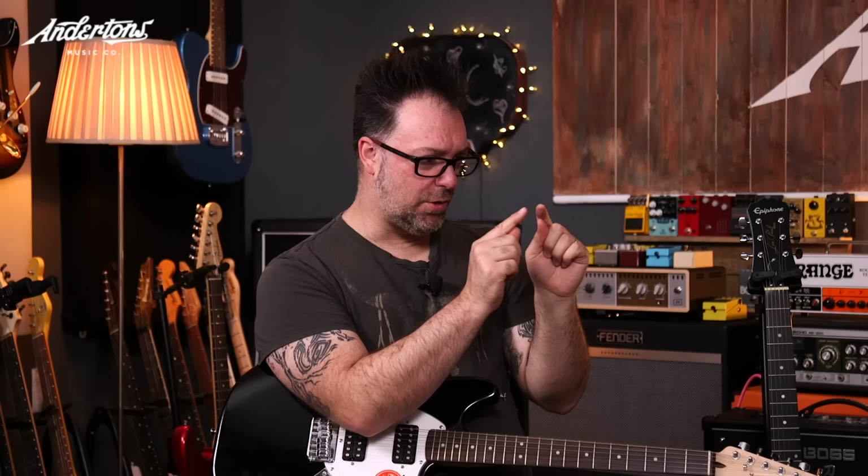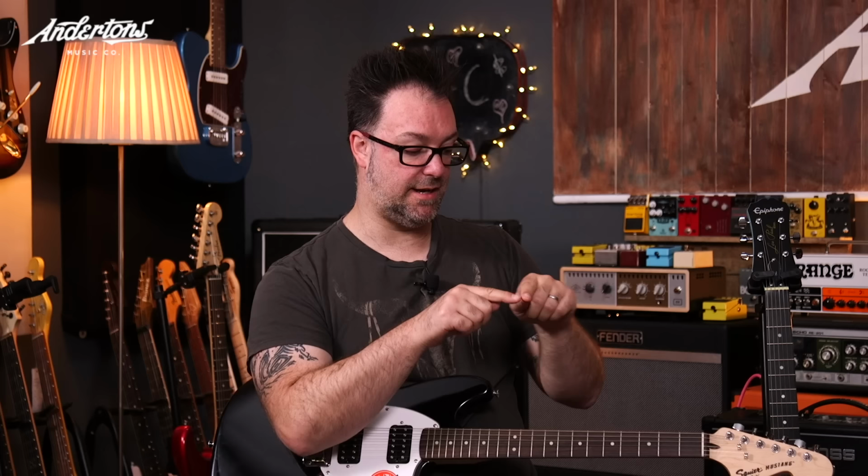So the tang is either all the way to the end of the fret, which is the normal everyday fret. The tang is the bit that goes into the wood. Or on slightly more high-end guitars, you can buy cut tang, so that it's tang in the middle, but then at the end, half a centimetre from the edge of the fretboard, there's no tang. So it's been cut tang.